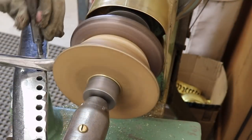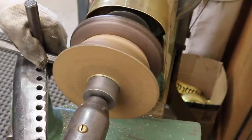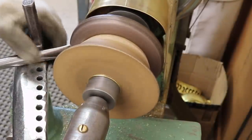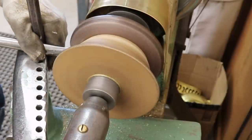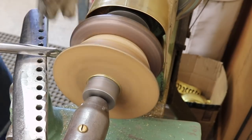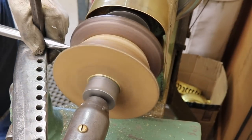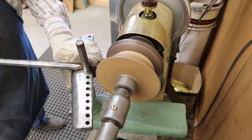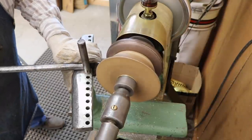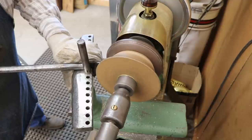I'm spinning the brass down tightly onto that steel part, especially at the outer circumference where the brass will remain and form the decorative polished brass band on the finished lamp. Here I'm cutting away the excess brass and leaving just the band that I want to be on the finished lamp.